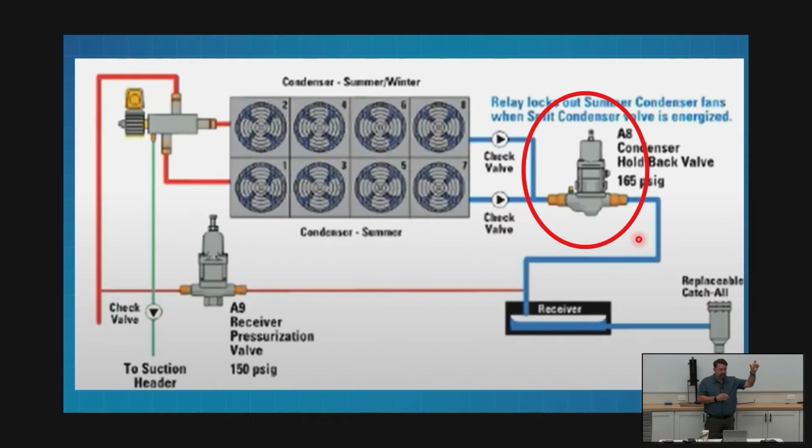All right, so we're going to talk about this for a minute and get this nailed down. But before we do, I just want to go through this process a few more steps, and then we'll get into the valve itself. The concept here is I'm reducing the size of my condenser. And when I've reduced it too much, then I let some of that liquid back out. So I can continuously flood more or less and maintain an exact pressure. It'll change how much is flooded based on how cold it is.